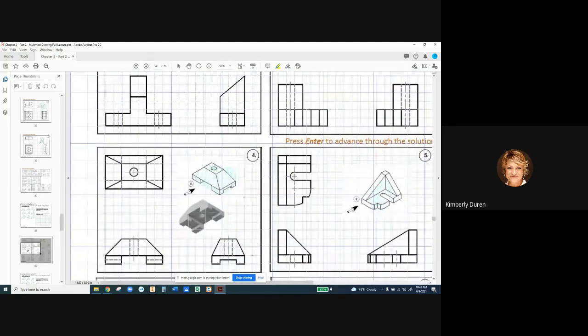Number four here is a pyramid kind of like a hip roof — it's angled on all sides and has a flat top. From this primary view I get my shape. This is flat and then I have an edge to an angled or incline plane. I have this break for this step that goes right through it — that is two units. You see this little half line — that's here because this is a half unit tall, this doesn't go all the way up. Therefore we have our hidden lines for that, and that cut stops. We have no hidden lines where there's no geometry. This hole goes all the way through, so the hole stops where the solid stops.